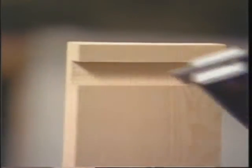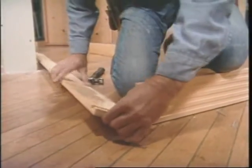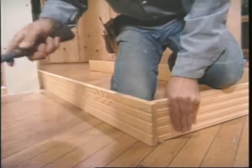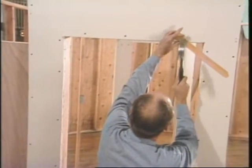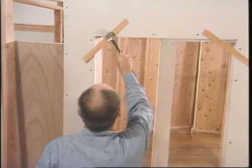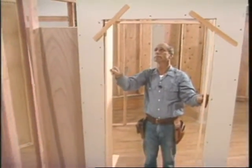Here's a handy way to make that measurement — use your combination square as a depth gauge, and that's three-eighths. After the head is cut to length, just nail the sides together. Six-penny nails would be good enough; three on each side will hold it. Door hanging is usually a one-man job, and when you work by yourself, you'll learn to do a lot of tricks and shortcuts. I'll just take a shim shingle and nail it on the surface of the wall here — when the door jamb goes in place, that'll make sure it's flush with the surface of the wall. This is the spreader, and it holds the bottom of the jamb 30 inches apart, exactly the same as on the top.